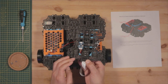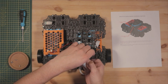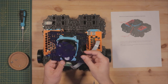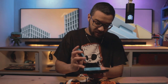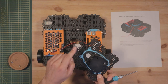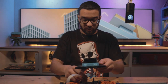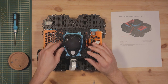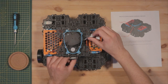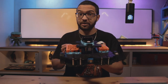Find the two 2.5mm holes on the front of the third layer assembly and line those up with the holes on the bracket. Install the screws and nuts — they're tiny little screws, so just stay patient and get them nice and snug. Once the camera module is attached to the front of the third layer, when you go to put it back on, make sure to feed your ribbon cable through the two standoffs at the front. Place it back down, pop your screws back in, and tidy up by feeding the ribbon cable underneath. Your camera module is now installed.